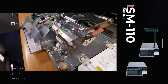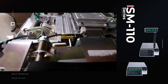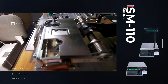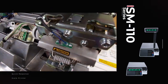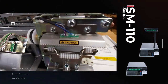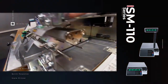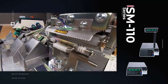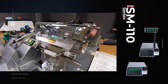The peel sensor ensures that the last printed label has been peeled. The last sensor is your thermohead open and close sensor — a small sensor that indicates when your thermohead is open or closed. With the gap sensor, you can bypass it with a spec if you are experiencing issues with the label peel sensor, or if you do not use the take-up reel and just want labels to feed out the front. It's also a sensor you can disable for bulk packing if needs be.